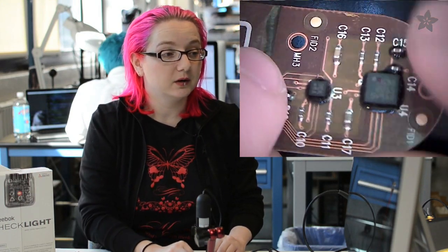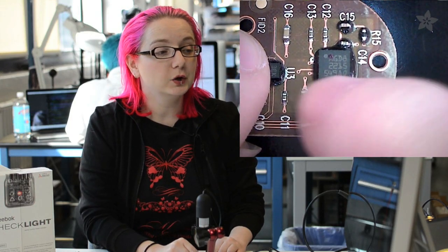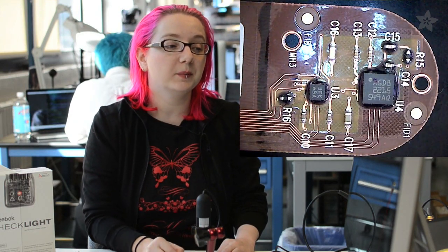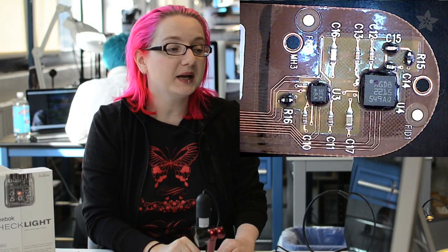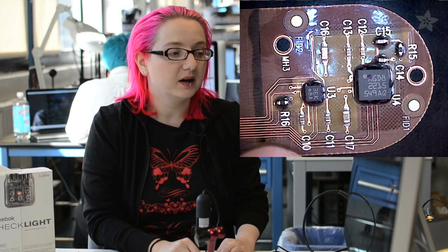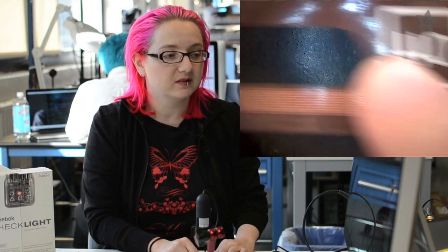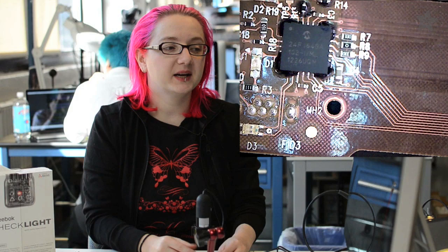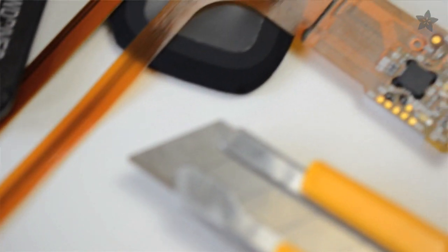One other thing I noticed while taking this apart is the black goop around the chips. That's epoxy used to keep the chips in place. They really wanted to make this a flexible circuit, so the trade-off is adding a step where epoxy is applied around each chip for stability and possibly some humidity resistance. All of these are I2C or SPI chips, and you can see the traces running all the way back down to the main processor. Because it's digital, it's fine going six to eight inches down this flex PCB. All very familiar parts put together to make a really cool little sensor.